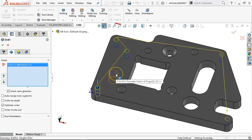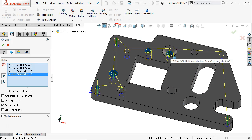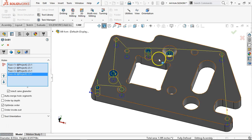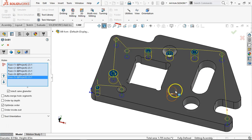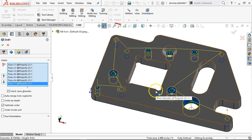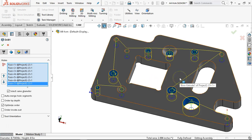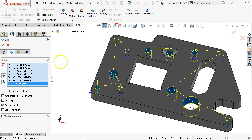So that finds the five tapped holes, and then I can go grab the next ones. The issue with the countersink is it sees it as a countersink already there, and it's not. I'm going to have to address that. I'm just planning on looping the half-inch tool through most of these and coming back and finishing. These are going to open up the geometry so I can either bore or interpolate the geometry into those holes.